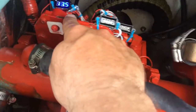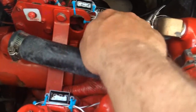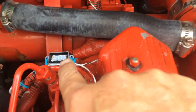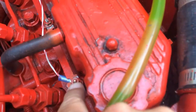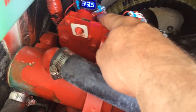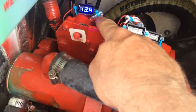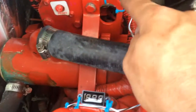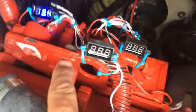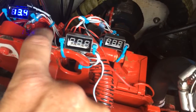I've got one over here on the main power to the engine, one here on the ignition, one over here on the fuel pump, and one over here on the glow plugs. The glow plugs circuit is hooked up right here on this circuit breaker. I have the main voltage coming in, and on this bolt on the back there's a lug I put on — that's the ground, so all the meter grounds go there.